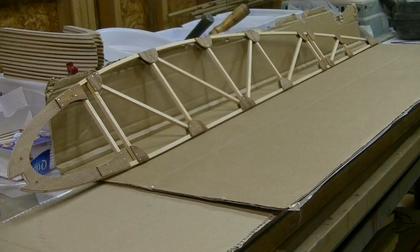And number three, and this goes along with adding lightness, a well-sanded wooden structure will not take as much varnish, believe it or not. Sure, it's a little more work, but what is 30 minutes per rib over the course of a whole airplane? It's not going to be really that much time.